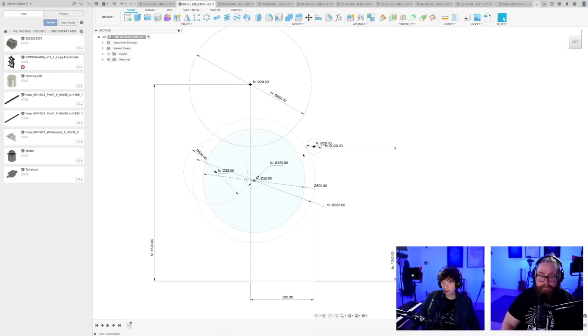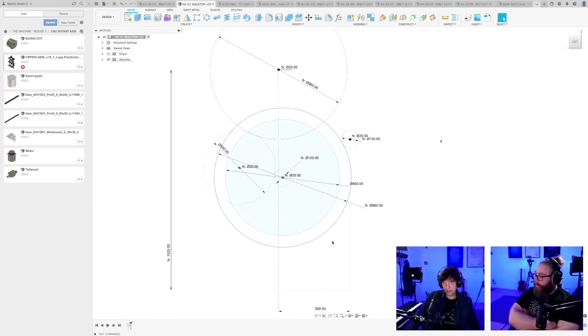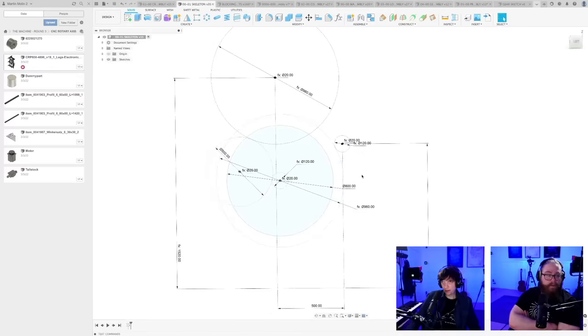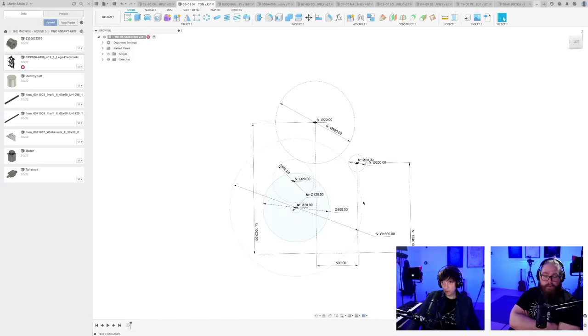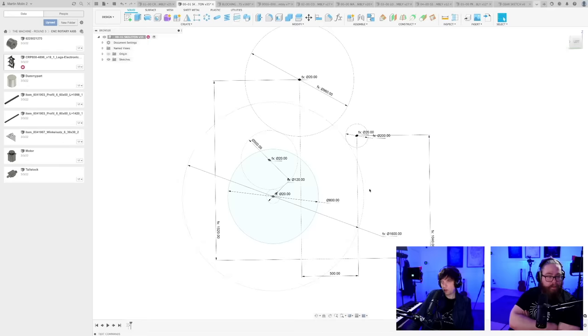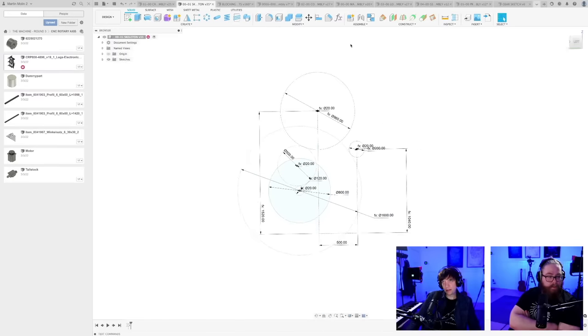And I could actually solve this equation by making this gear huge. Just to show you that, I can do that. Gear one pitch, if I make this 200, the first gear, this gear becomes huge and I have all the freedom I want, but I can't make a 1.5 meter big gear. So I'm constrained to kind of, the large things should be 1 meter in diameter, kind of.